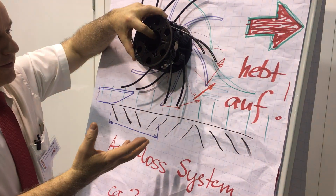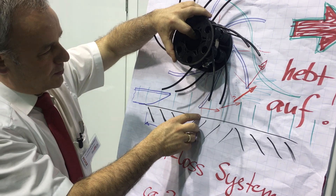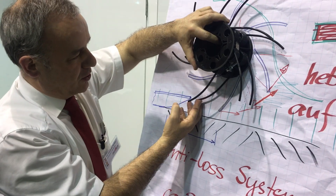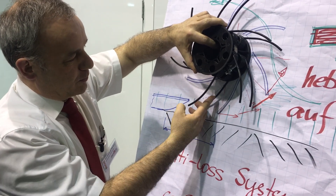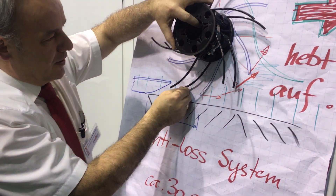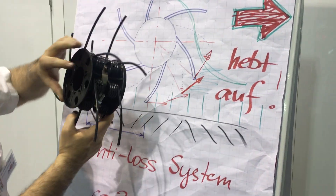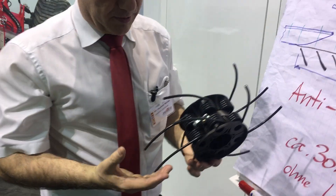This is very gentle for alfalfa so as not to knock off the leaves. When it comes to foreign objects, the tine will touch a stone for instance. With this geometry it cannot kick the stone into the grass, which is very positive. It will just slide over it, and if we dig into the ground it's not aggressive. In this way we have very little contamination.